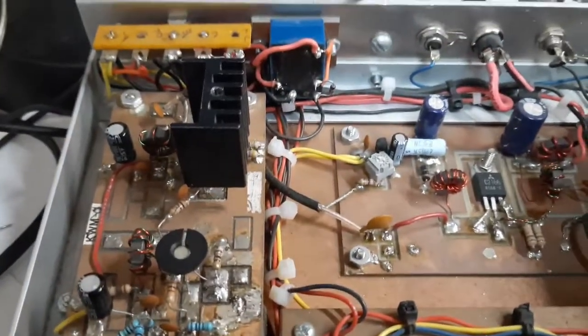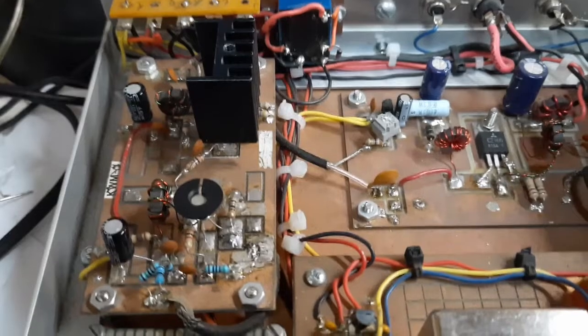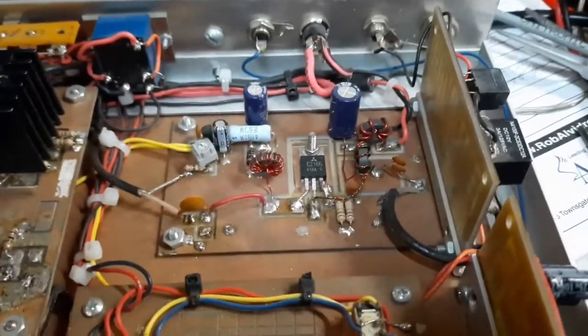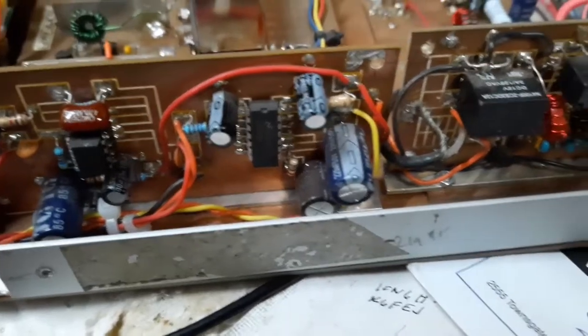This is the driver circuit out of EMRFD, with a 2N3904. I've got a 2N2222 in there driving a BD139, then a real RF transistor — the 2SC2166 right there. Over here is the microphone amplifier, and this is the audio stage with an NE5534.